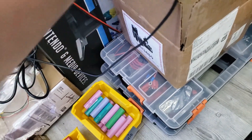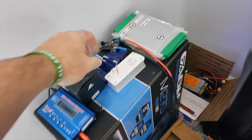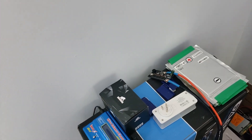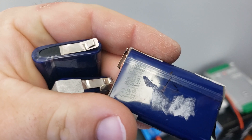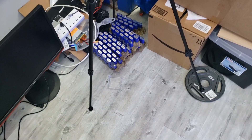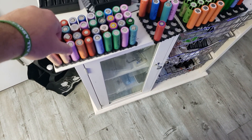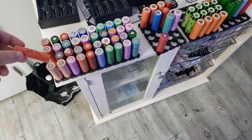Can't beat that — buying little BMS boards they're already a dollar a piece. I also got a couple of these cells with the laptop batteries and they tested out good — around 1800 to 1890mAh. I still think I've got enough batteries to do two more 24-volt batteries, about one kilowatt hour each. They haven't all been bad, but there's been a lot to throw away on these.